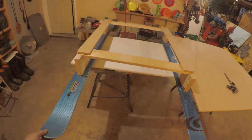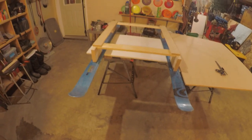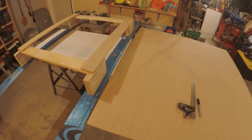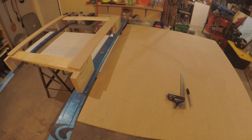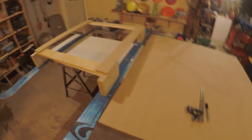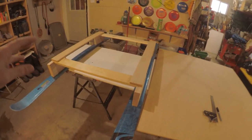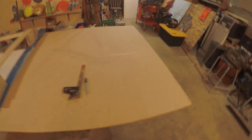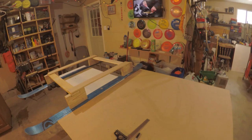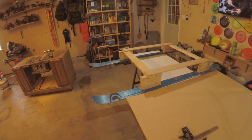I'm okay if it's got a little bit of play side to side. If that plan doesn't work, the next thought is to put a full deck on it. I don't want to put a deck on it just to save weight, but if it's going to completely come apart there's no point having it no matter how light it is. So first we'll try the screws — if it works, fantastic; if not, we'll go to the full deck and put a flat sheet across the whole thing, and that'll definitely stop it from moving.